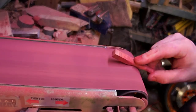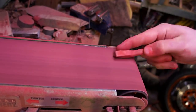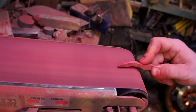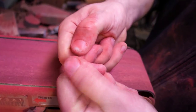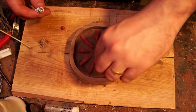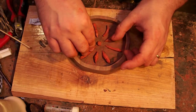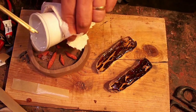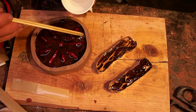Up to this point I still didn't really know what I was going to put in the center of the lid. Going back to those pieces I cut off earlier and glued together into a square — I decided to just freeform them on the belt sander and make some kind of interesting, organic-looking curves. I didn't know exactly what shape or size would look good, so I ended up making a few bigger pieces and then going back and shaping the ends on them. I decided that something a little bit more symmetrical would fit the piece better than a random pattern. After I had all the pieces rounded out on the belt sander, I arranged them how I thought they'd look good. I didn't use wood glue — I wanted it to dry really quick so I just used super glue to hold them while I drizzled epoxy over the top. The epoxy I'm using is the same Max CLR I use in all my carbon fiber stuff — I used little stir sticks to make sure I got it flowing all over everything really well.